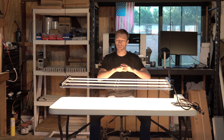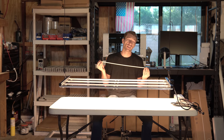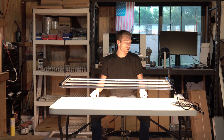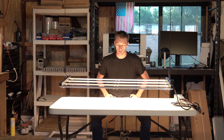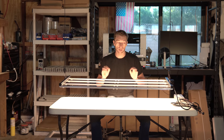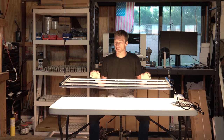Like I said, obviously this is a longer linear 2x4 fixture. We could easily use 23 inch heat sinks and build a more square fixture, similar to a 2x2 fixture, as well as, probably the most used, simply doubling this build up to create a 660 watt DE comparable design, which has much better uniformity and extreme efficiency. So that's the concept of this design and what we're trying to show you.